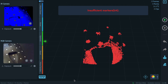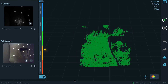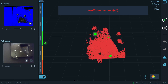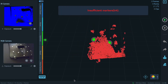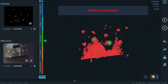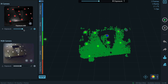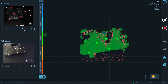Right away we can see that even at optimal distance, it doesn't see the markers. But the trick is to give it just one notch of brightness - that's it! Now we can scan at optimal distance, and even at a good distance we're going to get much better results.